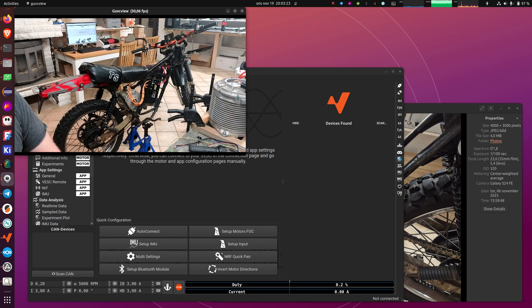What is also included here is an automatic IPM motor setup button that will configure things like maximum torque per amp and everything for you. It will also change the observer, configure the encoder, and so on. So it should be probably the closest thing we can get to a single-click configuration.